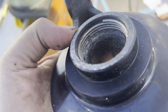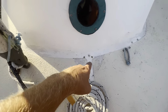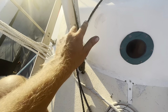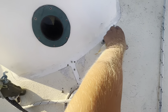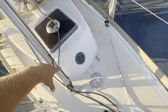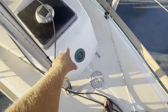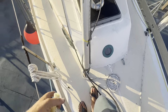I just mixed up a batch of thickened epoxy and I'm making some changes on the boat. I'm moving the pad eye for the whisker pole / spinnaker pole from the middle to over here, so I made some thickened epoxy-filled holes so I can re-drill that. Moving it over here gives you a place to sit and an open platform on the foredeck to do stuff. I filled the old holes as well.